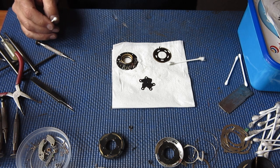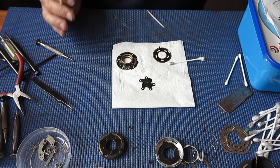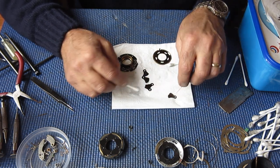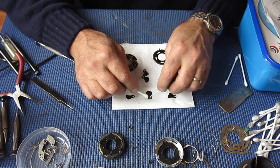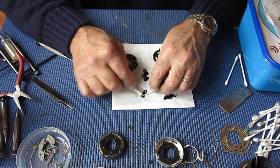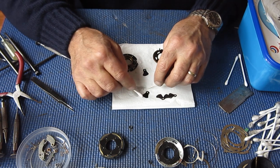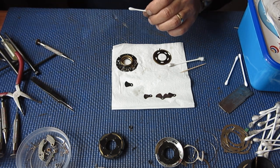The first shutter I'd chosen to be my donor, I couldn't get the retaining ring off the back. I'd mentioned that retaining rings were a problem with this model in particular. Well, as it happened, the retaining ring on the one I'd chosen to use had already provided a fight to someone previously. The original spanner grooves in it, the slots where you engage your spanner, were chewed right out. One of them was completely torn out. It had had new slots cut into the ring at 90 degrees from the existing slots, but it wouldn't come apart. There wasn't any chance of me getting it unscrewed.